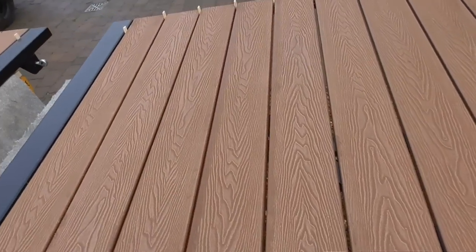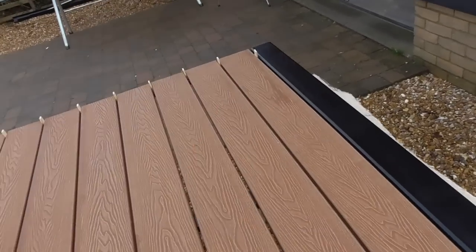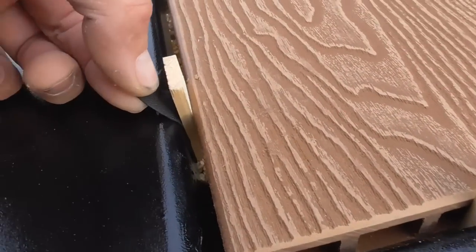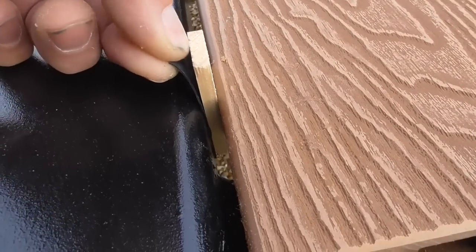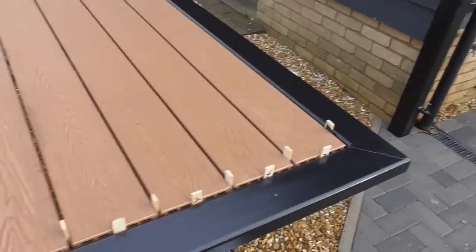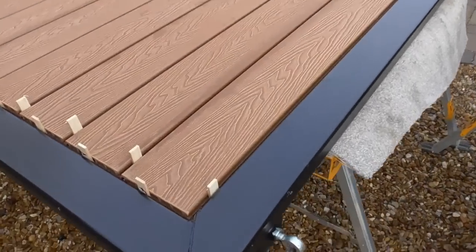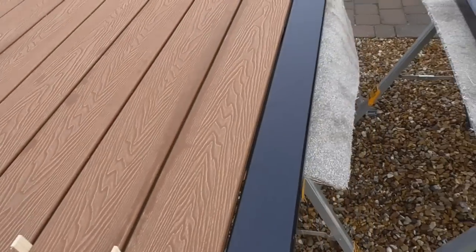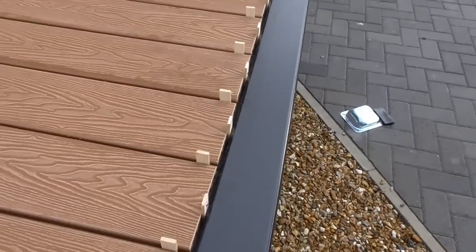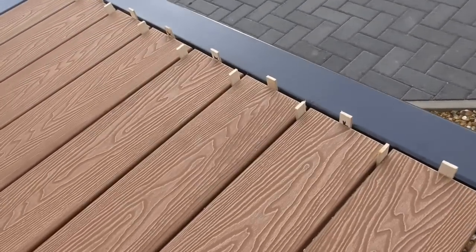The 5mm packers fitted perfectly in between there, and at the top here, look, I just had to put a tiny, not even a millimetre of rubber in. So it was only like 0.5mm wider at the top than it was at the bottom, and on this one it was absolutely spot on. So they look really great. What I've done here is just sanded off this top edge. I just thought it might make it look a bit softer as you look at it from the front.